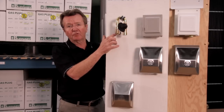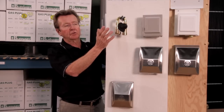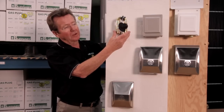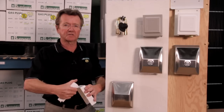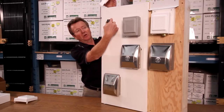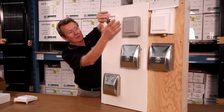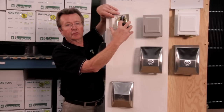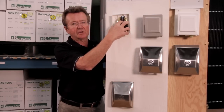Now you've got to test that joint. You've got to do that before you finish the project, right? So you'll leave that, you'll test it, whether you use soap tester or air pressure. You're going to take your PVC box, you're going to take the cover off as in the demo, and you put your cushion clip on the top. You'll slide your box over top. You'll put your screw, your mounting screw, through the cushion into the top hole. That'll secure the assembly to the wall.